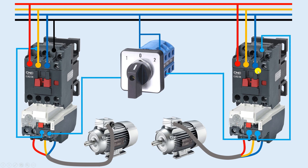To operate contactor two, I also need to provide neutral power supply. I will connect one wire from the neutral supply to the A2 terminal of this contactor. All connections are now completed. When you select position zero on the selector switch, both motors remain off. Selecting position one turns on the first motor, and selecting position two turns on the second motor.